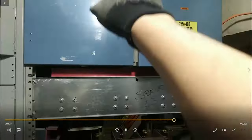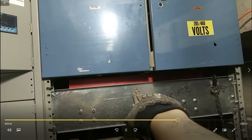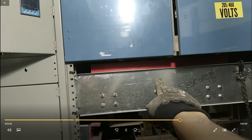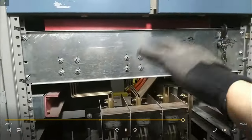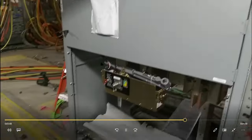This is the old switch that we had to remove. Those are the bus bars coming from the power company side — we're just going to join them here and they'll connect to the actual new service disconnect. This will be removed and become just an enclosure, kind of like a pull box. It'll all get closed up, and this is going to be the new switch.